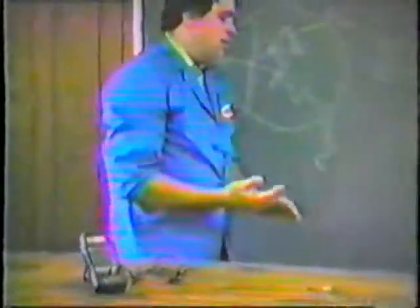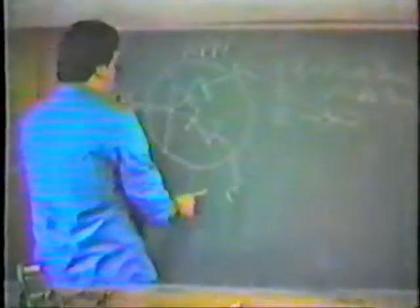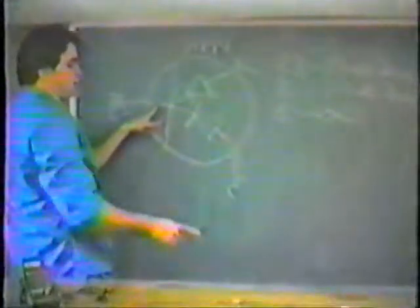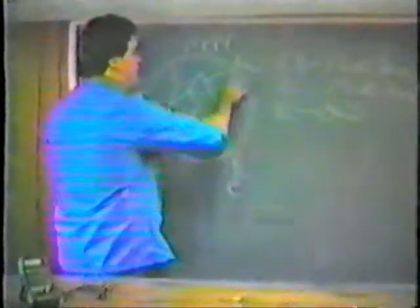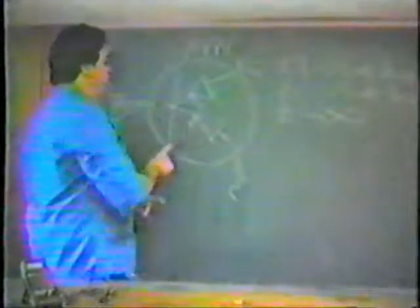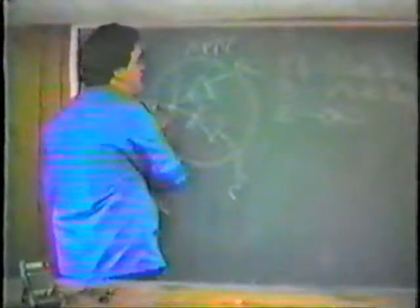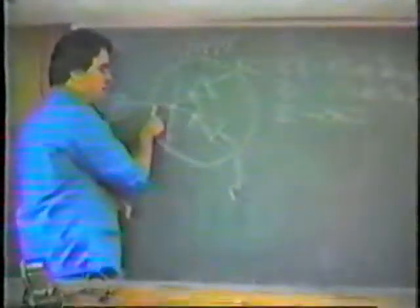So now you can see that what we've been saying is so. What we did, in fact, is we took a lead, put it on the base, checked the emitter and collector, and got the same or similar readings. Then we reversed the leads, put the other lead on the base, checked the emitter and collector, and again got the same or similar readings.